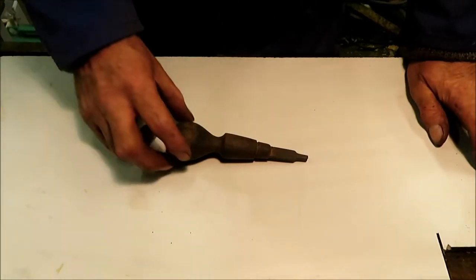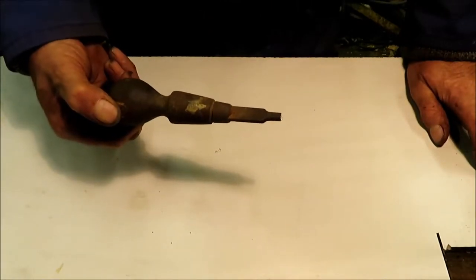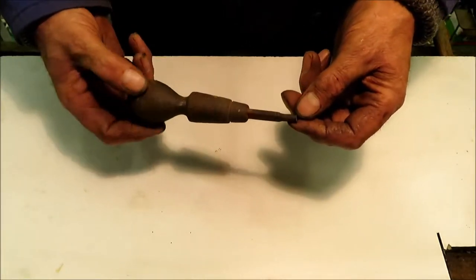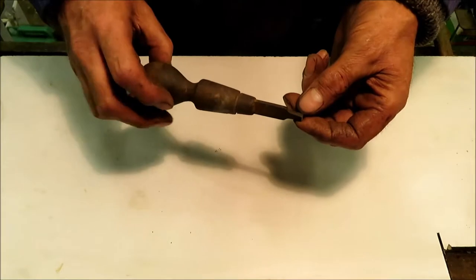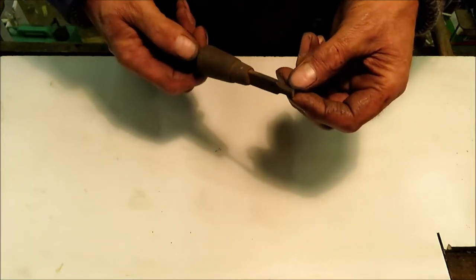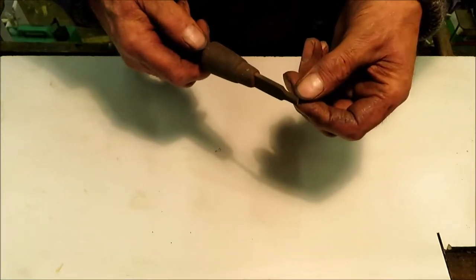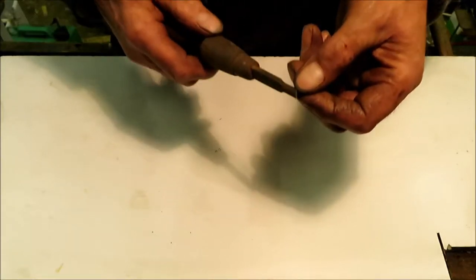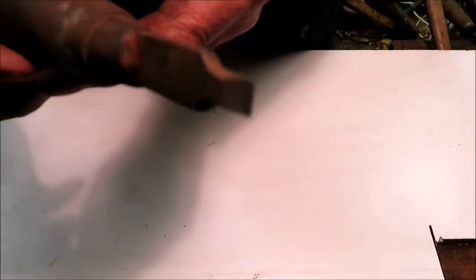So the first thing to do is shorten them — just take a hacksaw and cut the end off. Then we reshape the end to fit these screws on the guns. Most British guns have slots from 16 thou or 20 thou, so that's the size that we need to cut them. There we are — now that's the shape they want to be.